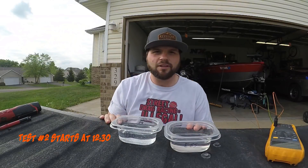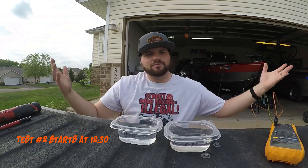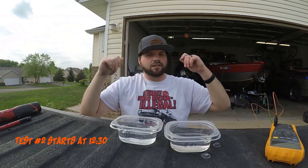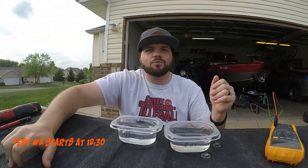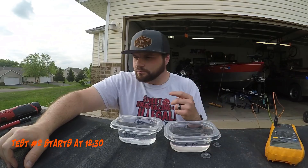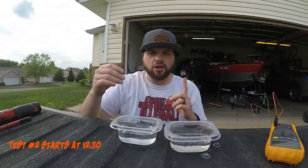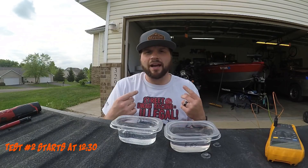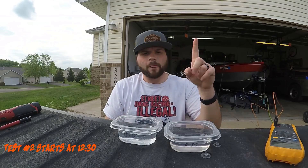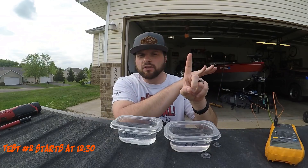It's really simple to describe dry bulb versus wet bulb. Dry bulb is the temperature you feel right now — it's 75 degrees, that's what you see on your phone every morning. Wet bulb is the temperature with humidity corrected. So if it's raining out, it's going to feel colder at the same temperature. The simplest way I can think of: if you lick your finger, your finger feels colder. Does it mean the air around your finger is colder? No.